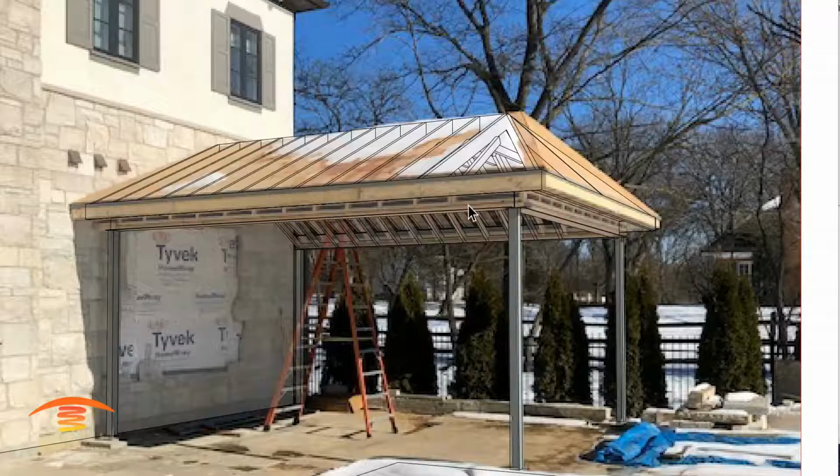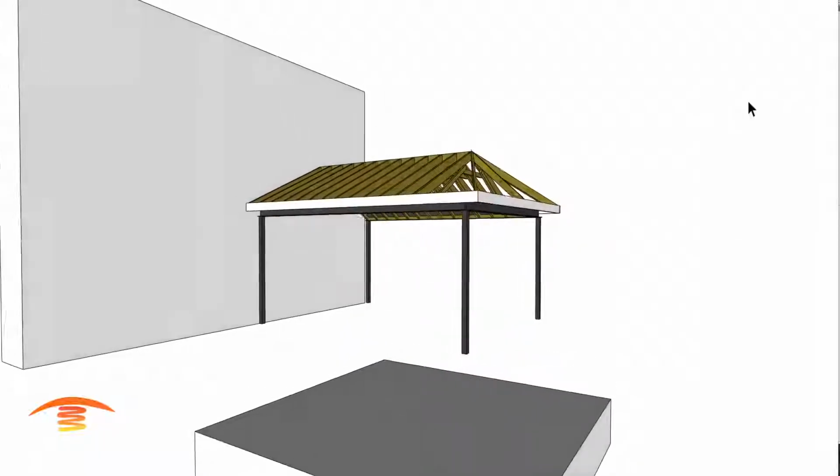Today we're going to take a look at this residential structure coming off this home here. What I have the most concern about on this space is two things actually. If we use gas heaters, then we are required to get some kind of ventilation for the ceiling area so that the exhaust gases will flow out of there properly. And two, I know there's going to be some can lighting in here, and I'm concerned about the actual placement of those can lights. Customer wants the entire space here heated properly, and so let's just go right into that.